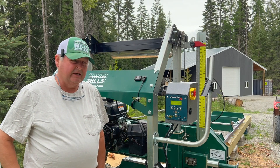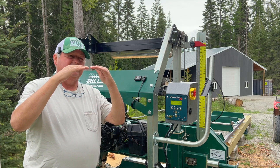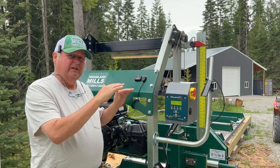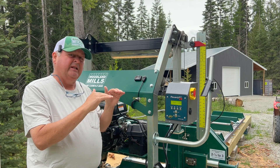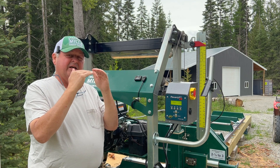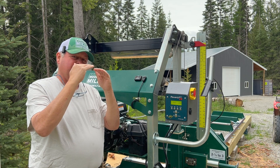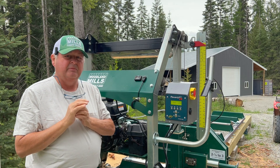Welcome back to the mill. Today we're going to calibrate the sensor that comes with version 3. This sensor allows the mill to know how far off the bottom it is. The first step is to lower the mill as low as it'll go without any slack in the cable — you want to get as low as you can where there's no slack, so the mill is actually doing something and not just taking slack out of the cable. I did that by getting a little slack, then going up until I could feel the mill starting to move, and stopped there — that's my bottom.